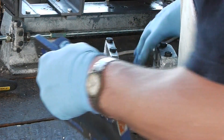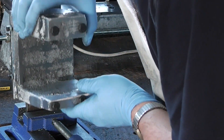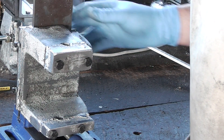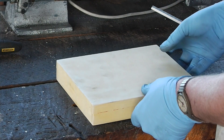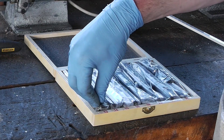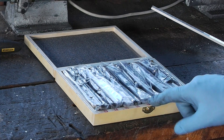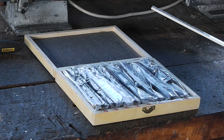I have a crazy, possibly stupid plan. Any wobbling is because the bench is crap and not flat. This is a set of reduced shank drill bits — normal drills top out at 13mm, this one starts at 13mm. So I'm going to step up through them until I get to 20mm, which is the diameter I want to start that bore at.